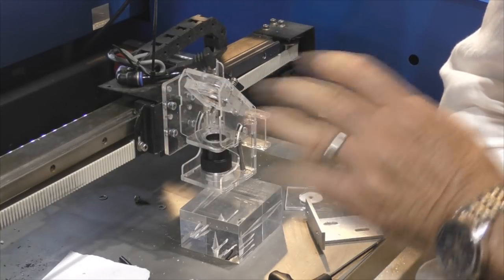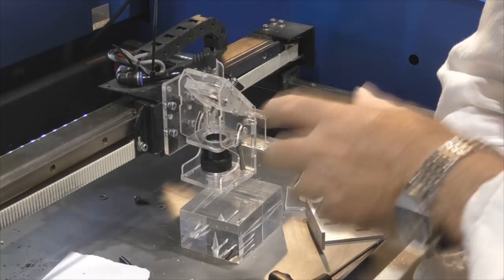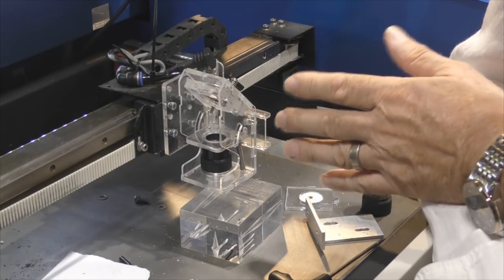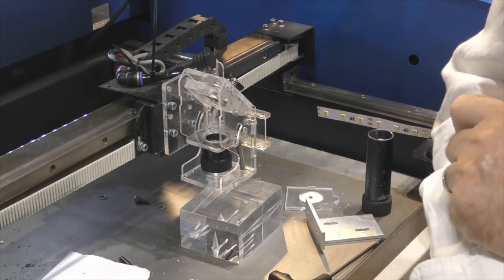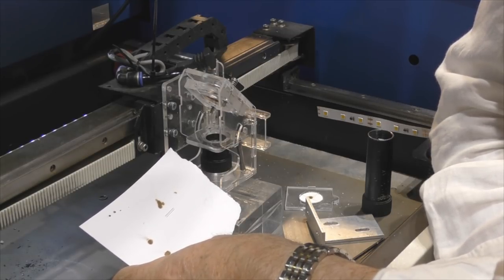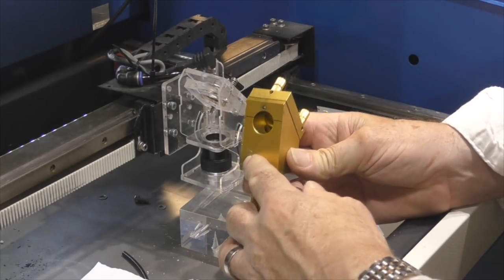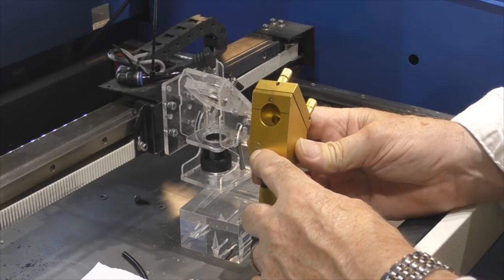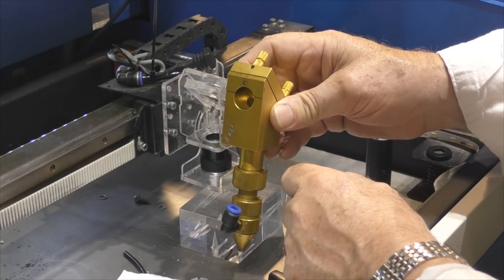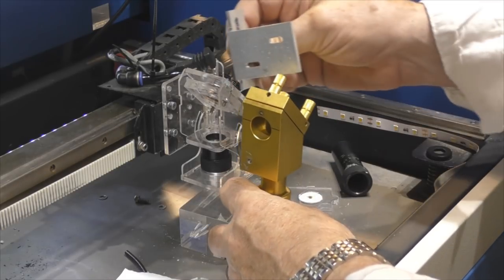What I've got to do now is abandon this for a couple of days while I go away and design and get manufactured a heavy-duty steel bracket that will ensure that even if I've got some small oscillations, the frequency will be so high and the amplitude so small that we won't notice them in our test pattern. If you see any patterns like this and do remove that little strap on the front of the head that straps it back — that looks like a bodge — you'll be exposing yourself to a risk of this sort of problem, because this is a much heavier head on a much flimsier bracket.